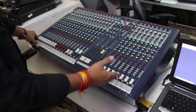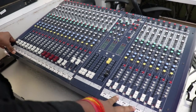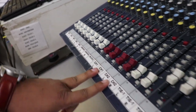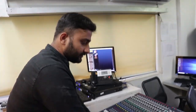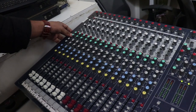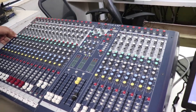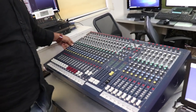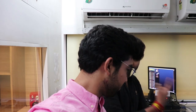Sound is managed from the audio console. This is the audio mixer — a 24-channel mixer from where the output audio goes. All channels are divided: mics, breaking news PC, music, playout, director coordination, tie lines, phones, and Skype for guests. They have six auxes assigned for different purposes — one aux is for the director to talk with the anchor, another for fold-back, and others for phone guests. The audio is managed here and the output goes from this.